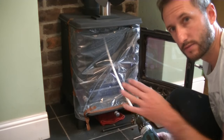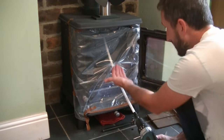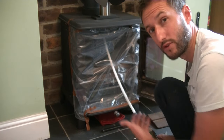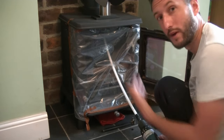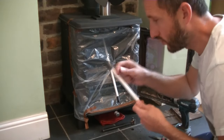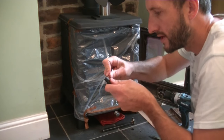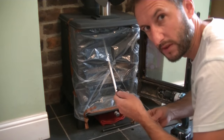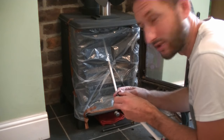Because these rods are so flexible, you can see that I can attach the drill about a metre away from the wood stove. So although I said earlier to have it at an angle, it doesn't actually make much difference — as long as you're careful and go nice and slowly. One of the rods I found a little bit stiff — the button wasn't going all the way down — so I'm choosing a different rod, and if I need that one later I'll put a bit of WD-40 or some releasing fluid on it.